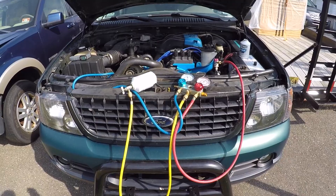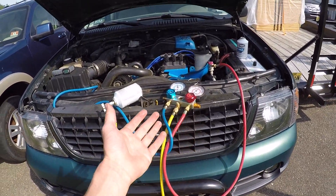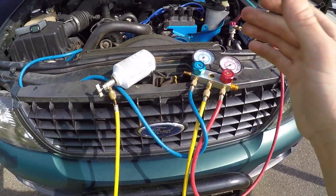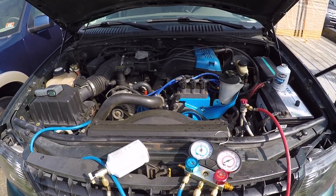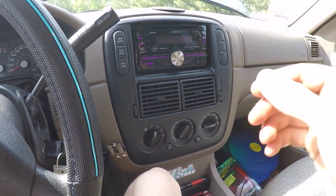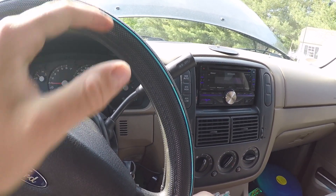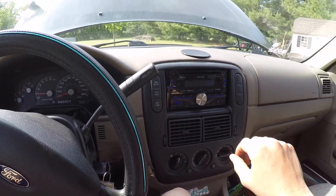That's how to add refrigerant to your Ford Explorer or any vehicle. Use these gauges, use the R134A, all you need is a thermometer. The gauge converts the temperature for you, you get your superheat, and you can get the AC running real good — it'll feel real nice inside the cabin. Thanks guys — my channel has about 489 subs now. If you have any questions leave a comment. Once you get the superheat down, your AC will feel great.